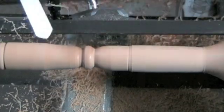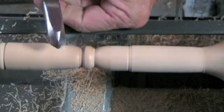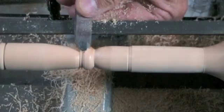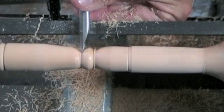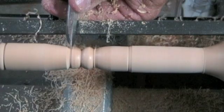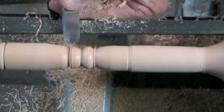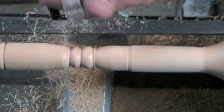Keith Tompkins has tried to take the skew in a little different direction by grinding the bottom somewhat convex with a point. You get the advantages of kind of all three: I can do planing cuts with it, you can roll beads with it, and it's a very forgiving tool when rolling beads. You can stick it straight in to get your V cut. You can also cut somewhat like a toe cut using the skew, and then roll your beads. So this is a very similar tool — it's taking all of the different versions of the skews I've showed you and putting them into one tool.